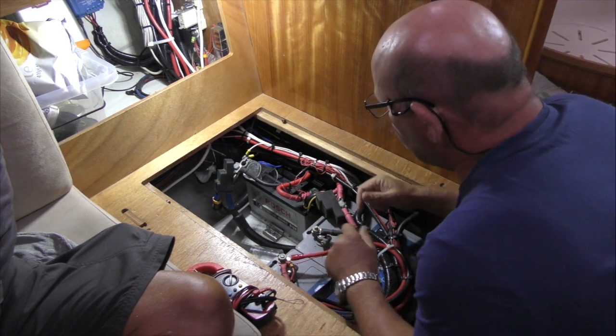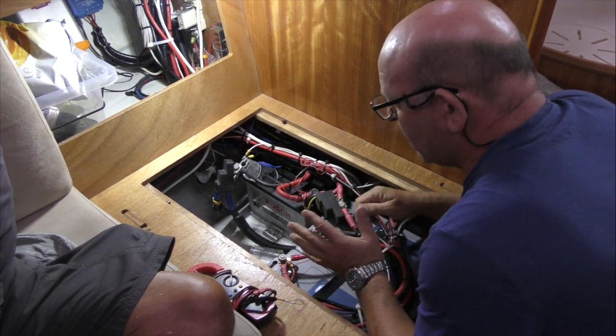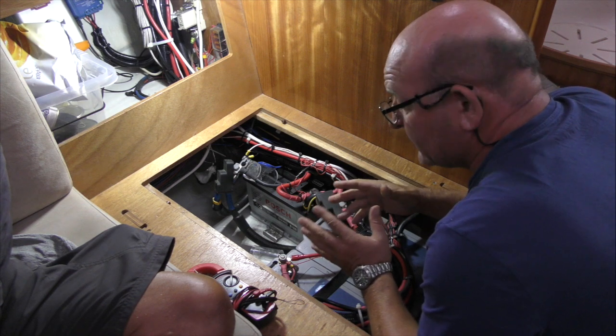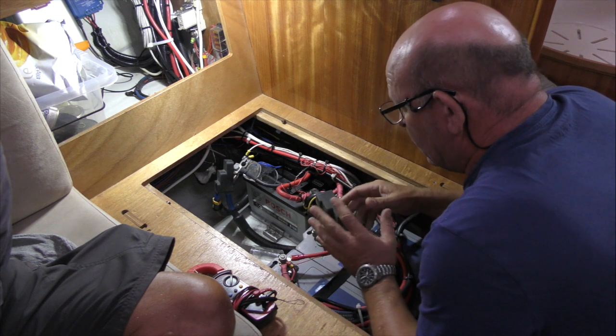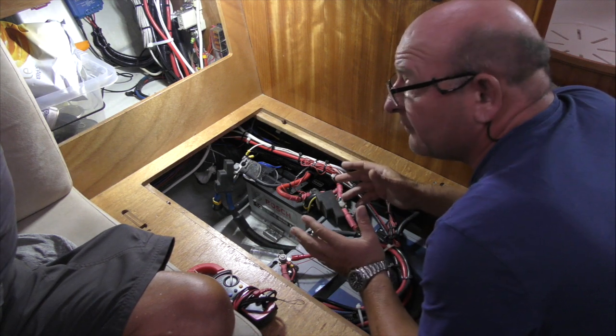What can happen with them is that they don't get charged up. You go out sailing, you go out of port, you start your engine, that uses lots and lots of amps over a very, very short period, 10, 15 seconds for the heaters, and then 2 or 3 seconds for the starter motor. That is actually quite a drain on the battery. You run the battery for the engine for 5 minutes.